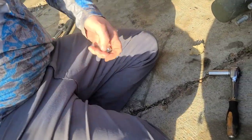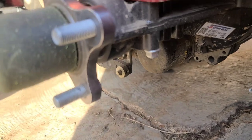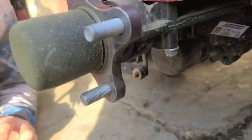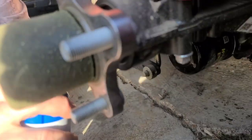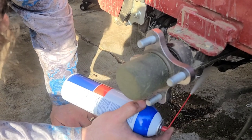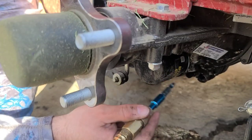You can kind of clean it — not too bad. So there's two bolts; keep them all together. Now what we're gonna take is an air pen. You want to clean this area around the air filter so no dirt gets into that hydraulic pump. Air pens are very helpful. Then what we're gonna do is go down here and clean this whole area around it. Make sure no dirt gets in there. I'm gonna use some carburetor cleaner to get as much of that out of the way as I can. As you can see, all that dirt and debris is gone.